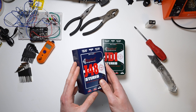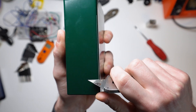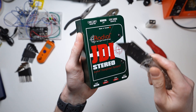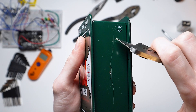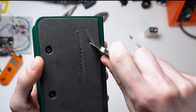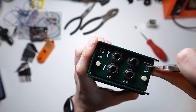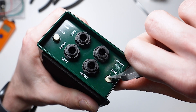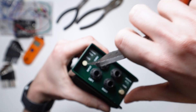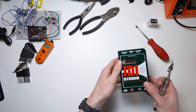Now that we know what that sounds like, let's take a look at the outside of these DI boxes before we see them from the inside. Let's start with the passive DI. With my razor blade, I can verify that all sides are made from metal — steel to be exact. The green enamel coating comes off when I scratch it, pretty expected. The bottom of both DIs have a soft foam layer that'll prevent them from sliding around on the ground. There's also two screws that we'll take a closer look at later. After heavily scratching some of the text with my razor blade, we can see it's still pretty readable. All the buttons are made from plastic, and we have two pad enable buttons for their respective channels since this is a stereo DI, and we have two inputs with throughput capability. Flipping it around, we have a shared ground lift button for both channels with two XLR outs. This side is still made from metal.